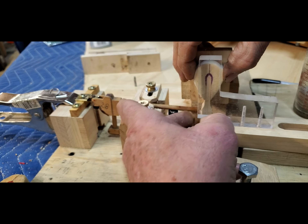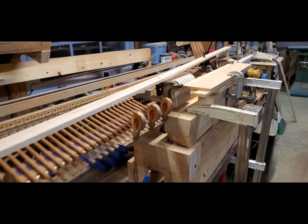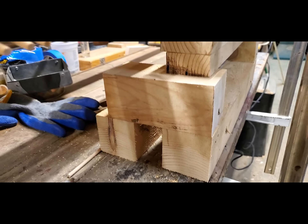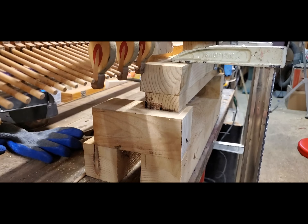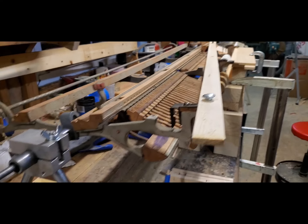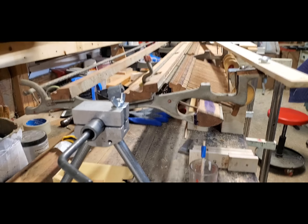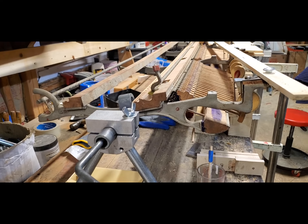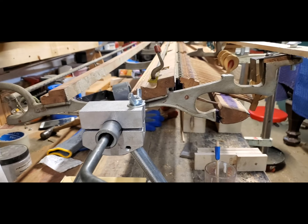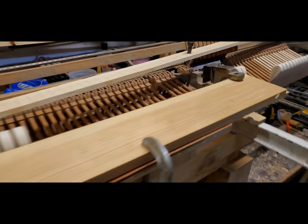Now I'm ready to do this. Here's my hammer hanging jig that I'm dubbing 'the beast.' Let me move this glue bottle. See, there's the beast — all those big timbers. The purpose of the timbers was to raise it up off the bench so that I can use this rack right here. With this rack I can swing the action all the way around and work on any part of the upright action comfortably. Right now I've got the action in there horizontal and the hammer hanging jig set up.